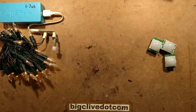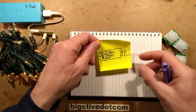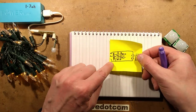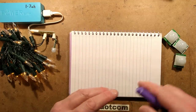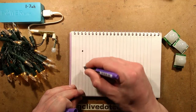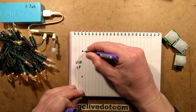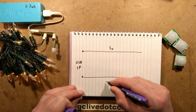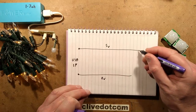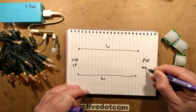The circuitry is very simple. I didn't even draw a schematic for this — I just doodled. This is the first doodle I did, just a very rough sketch on a post-it note, and then it went straight to the printed circuit board. The idea is: USB in, so we've got a five volt rail and a zero volt rail. That goes to a connector for the passive infrared module, the PIR module.